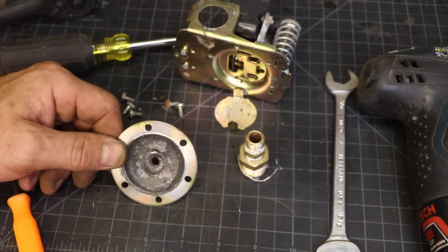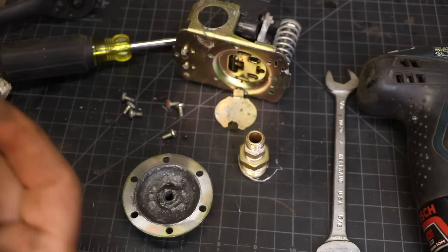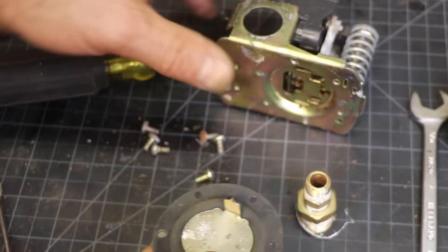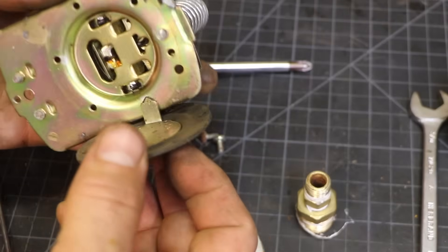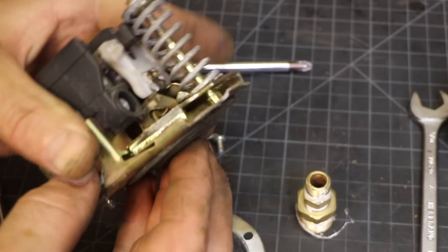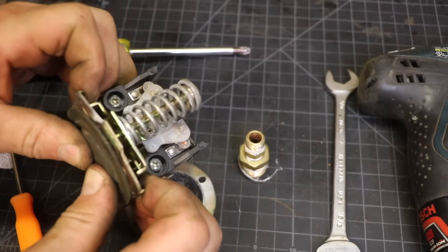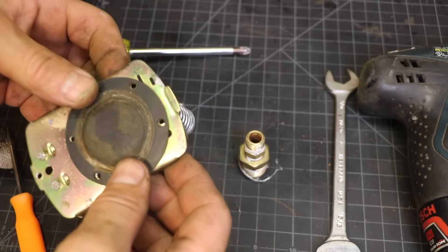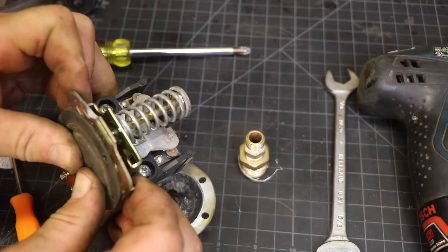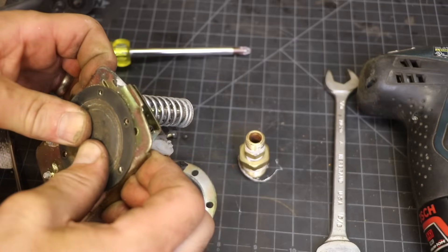I'm going to go clean this up on the wire wheel. So pitted metal, but it's got plenty of thickness so that's not a problem. Diaphragm is nice and flexible. Here you can really see the mechanism — the diaphragm pushes on this piece of metal, which reaches up through on both sides and pushes on the other piece of metal that the spring is pushing on. So it is actuating the switch exactly like I was when I was doing it with my fingers. It takes quite a lot of force to do it. We are talking about like 50 pounds per square inch, and that's more than a square inch, so it's probably like 70 pounds you have to put on there to actuate that thing.